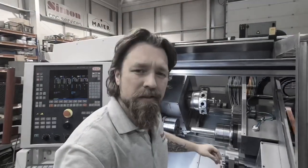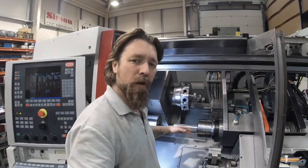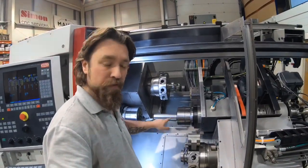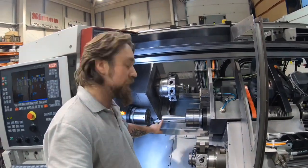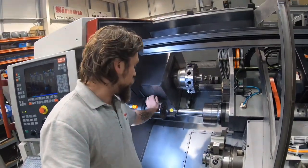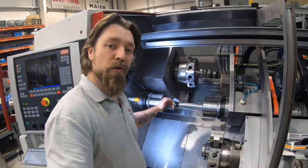So that's the turn testing complete. The V-axis is now clocked out perfectly parallel, actually within 2 microns over the 190mm we have here. Brought it in then up to the main spindle, clocked round top to bottom, 0-0.